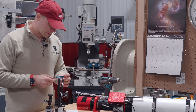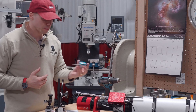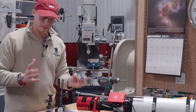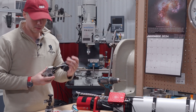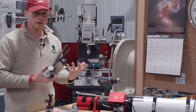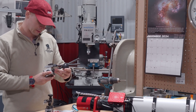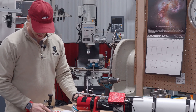The equipment I'm going to be using — we'll probably break this out when we do the rotation test to see if there's backlash. But for the most part, I'm going to be using test indicators. These are Brown and Sharpe indicators, which are quite expensive — you can't even get them anymore. This one in particular measures half of a thousandth, or five ten-thousandths.